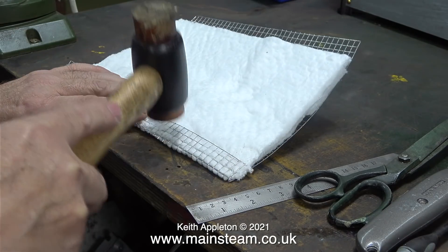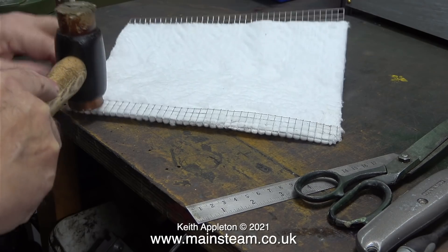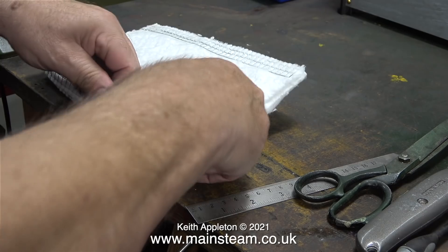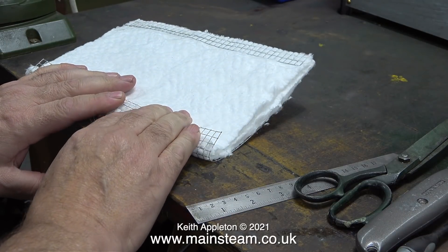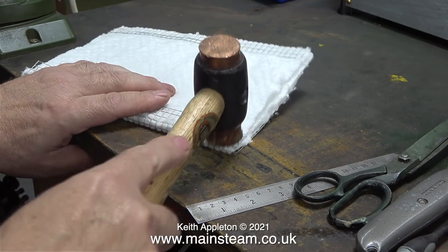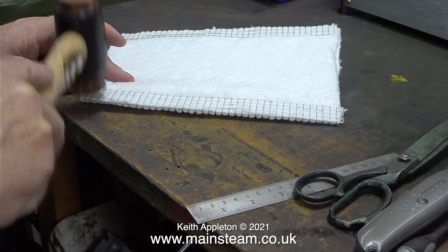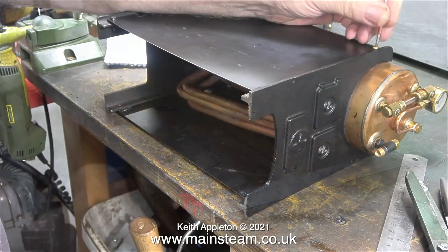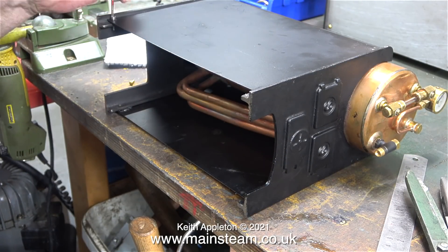This is my first attempt. I simply bent the mesh over the edge of the thermal insulation, first at one side and then the other side. I didn't need to cut a lot of mesh to cover both sides of this insulation — in fact that would have been counterproductive because the mesh itself would have got very hot. This is going to be the inside surface that faces the burner, and once I flattened the mesh using a soft hammer it really gripped the insulation.